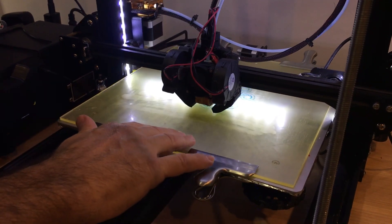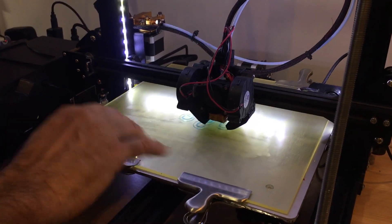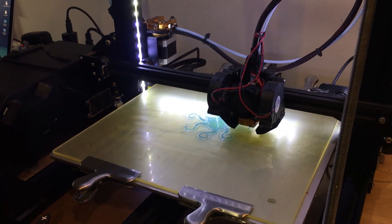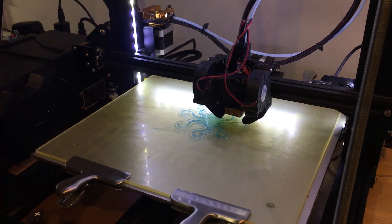Right now it's laying down the first layer going pretty fast — I have this set at 50 mm/s. I print on PEI on glass, but since it sticks so strongly to the PEI, I actually have to put glue stick on it to act as a peel-up layer, which then I have to clean off. That's kind of gummy unfortunately, but I get good results. Without the glue stick it just sticks almost permanently to the PEI and I really have to force it up.